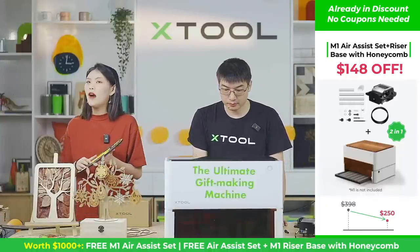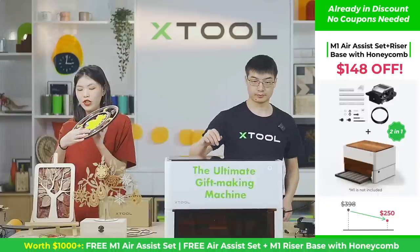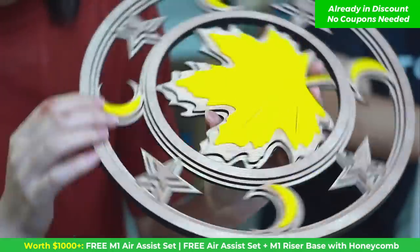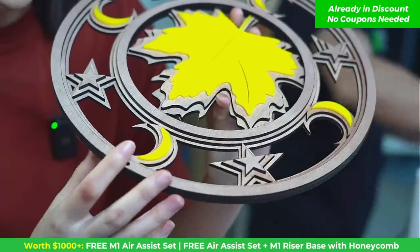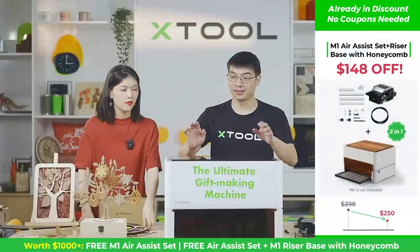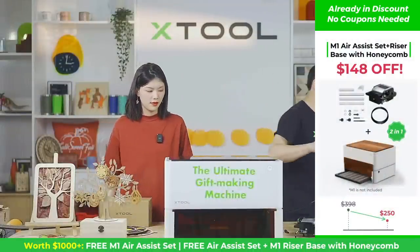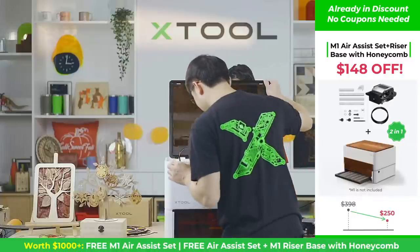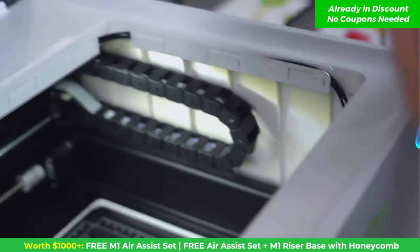About the power of M1 with the AirAssist set, it can cut through yellow acrylic in 3 passes. This is a 3 millimeter acrylic plate. Okay, so let's see if with the AirAssist we can cut the thick wood through or not. Here we can see the cutting edge is actually very clean, but it's still not cut through.